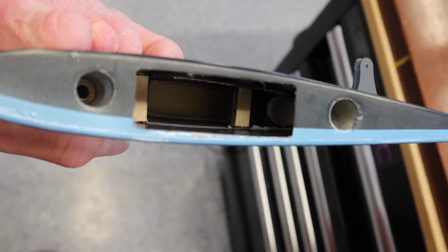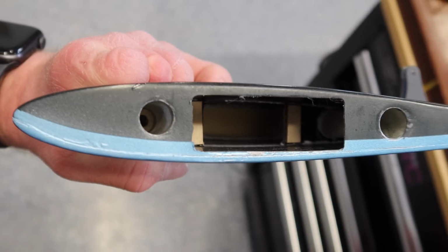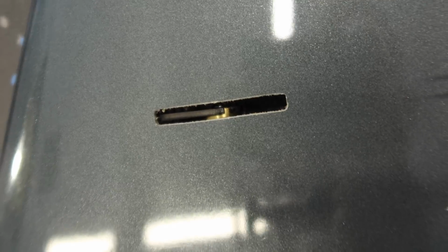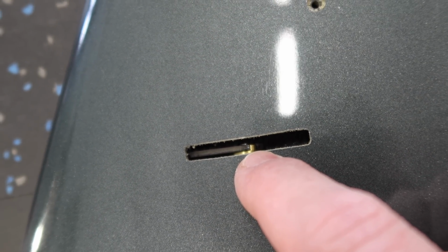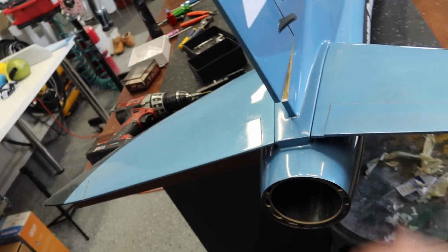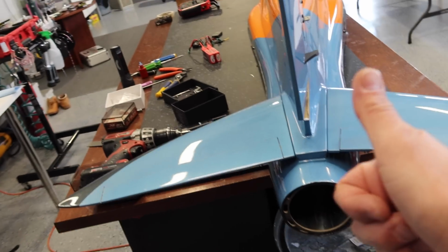So what I do now is install the servo, and then once the servo is installed, there's just enough room to drill the holes, and we'll get that screwed in place. Now the servo is definitely a tight fit, but you can see there we are right bang on in the center of our channel. That is exactly what we're looking for. Okay, so our tail section is all complete. We've got our elevators on, our rudder is all done other than the linkage, and that is good.